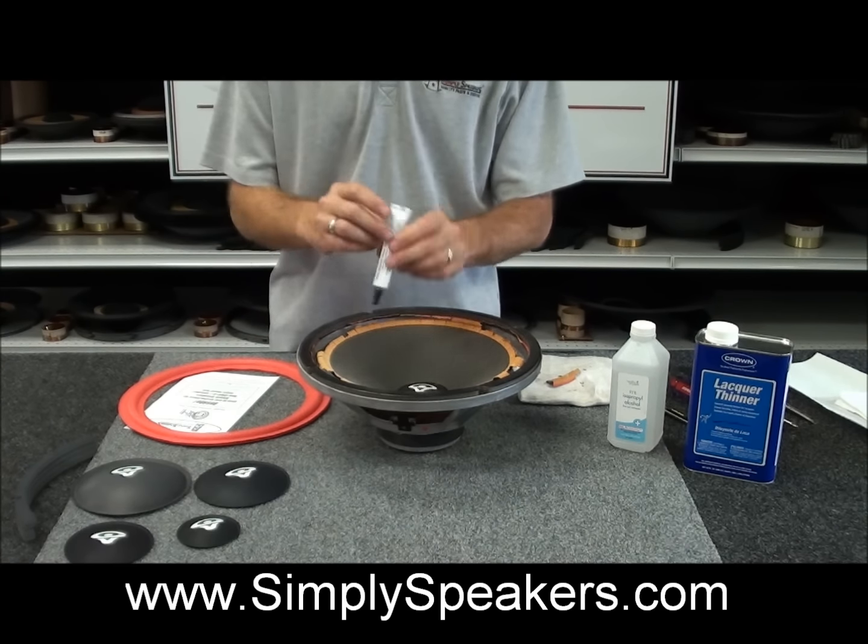Sometimes the customers will send us photos of repairs that they're working on, and they take Dremel tools and things and clean this, and that's all not really necessary. We just really want to get the old foam removed here from the frame like this. Just a light scraping action all the way around. We'll take care of that for you. And really that's all you need. Okay, there's a little yellow residue left on the adhesive, that's fine. Some little pieces, just clean that up.